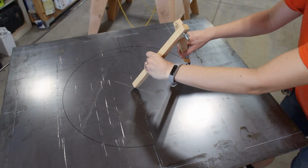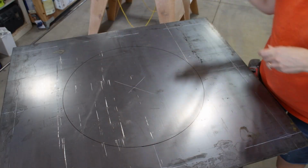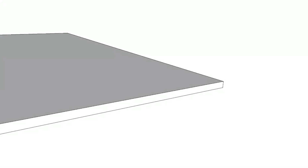So the first thing I did was to use a compass to mark the center opening. Knowing where the center opening was helped me find the locations for the mounting holes. Instead of creating small circular holes to accommodate the screws, we decided to plan ahead for that pesky old expansion and contraction of the wood and create slots instead.